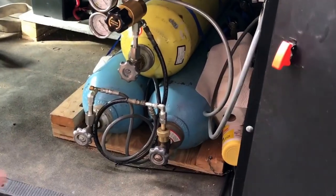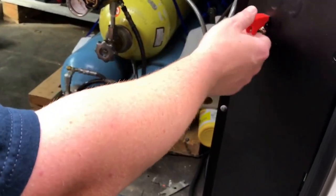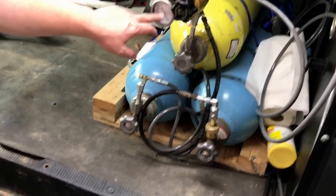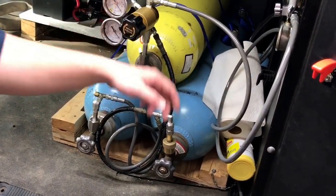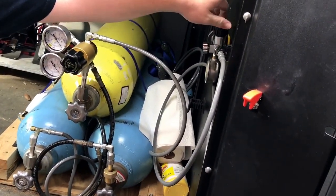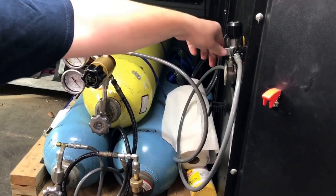In this video we're going to go over how to fill these three big cylinders — the cascade. Right here there is an adjustable wrench. First thing you want to make sure is there's no pressure on this fill line, because you will get hurt if there is pressure on it. I'm just going to crack it open just to make sure there's no pressure. There's no pressure — I'm going to go ahead and close it back off.